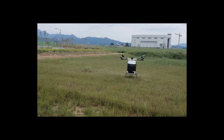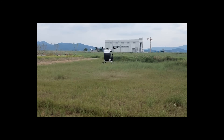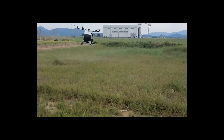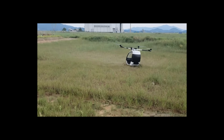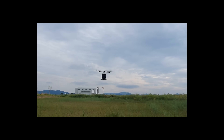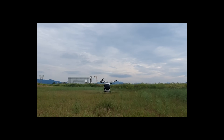I reworked the damping structure to minimize vibrations, added reinforcement where needed, and optimized weight by re-machining parts with CNC. EMI issues during flight forced me to redesign shielding and add ferrite cores everywhere. I kept solving each problem one by one. And finally, the day came when I thought: I think it's ready to fly.